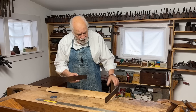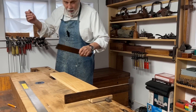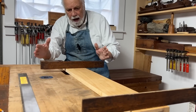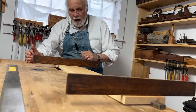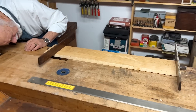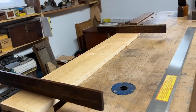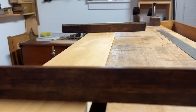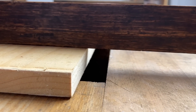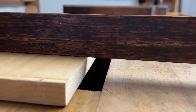The way that they're used is really pretty simple. You put one stick at the end of the board and then you put the gaffer — typically called the gaffer, that's the old English word for the boss — at the other end. Providing you keep them parallel, if you now sight down across the top of the gaffer you should be able to see that the top edge of the gaffer matches the top edge of the far stick perfectly.